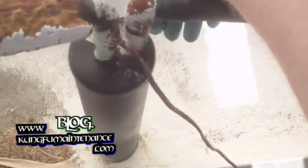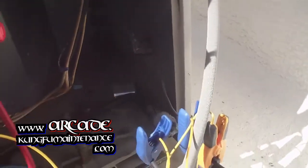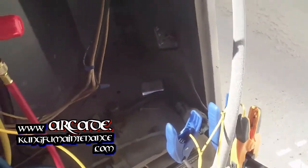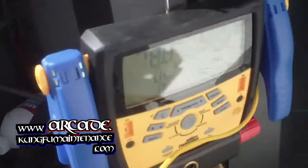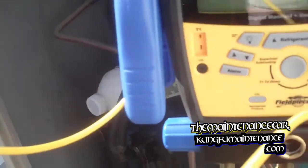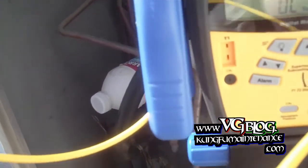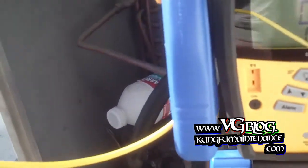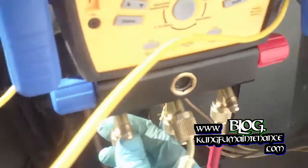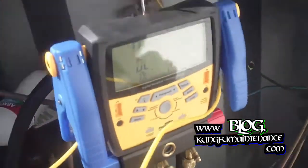We're good to go there — unit's all charged, nice and chilly. One AC, good to go. Just got to bag everything up here and get it off the roof. Get back to actually chilling myself — oh wait, I've got to go fix a washing machine. No biggie. So now we've got everything getting disconnected — just want to release all the refrigerant from the lines, avoid trapping anything, leaving anything trapped in the lines. We're all set there. Finished bagging everything up. Good to go.